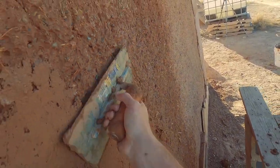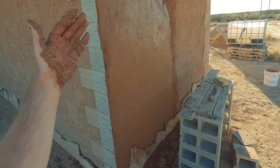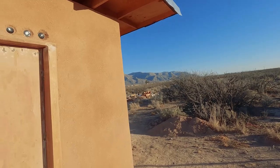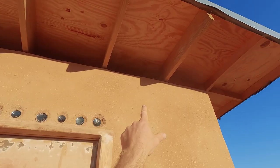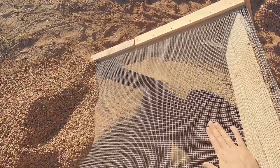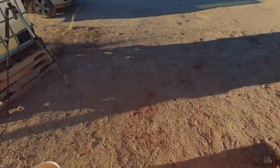For fully exposed earth buildings it could be one to three years before you have to do touch-up work on the wall — and that's kind of unthinkable in modern society where most people don't know the first thing about working on the home they live in. It just wasn't always like that. For the brown coat I'm using a finer material — this has been sifted down to a quarter of an inch, so there's no larger than quarter-inch gravel in the mix. That's going to allow us to apply it thinner and it's going to be smoother. Same mix ratio with sand at 1-to-4. I've got different straw for this though — for the brown coat I'm using chopped chicken bedding straw from a tractor supply store, which is finely chopped and looks great even in a finish.